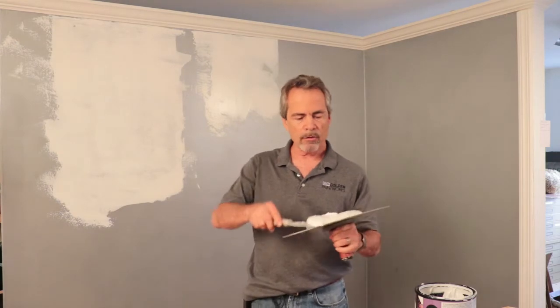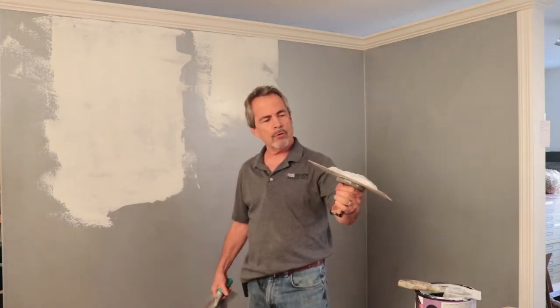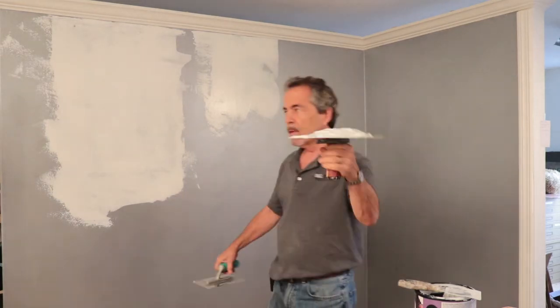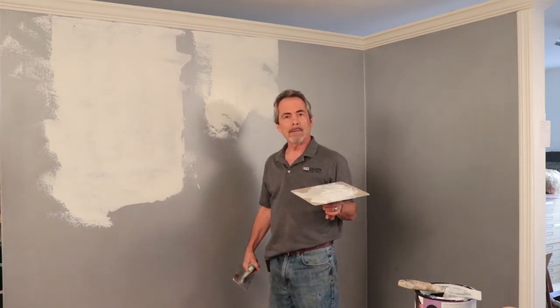If you do want to work with a hawk, let me show you how. The material has to be thick enough that it's going to stay on the hawk. I want to put it right into the center. The material has to be thick enough that you can rotate it down like that without it falling off. This is a fully loaded hawk now. The material is fairly loose — that's probably about as high as I could make it. If you want to make it a little more stable, give it shoulders: go all around it and just bevel it down. That will help it stay on there longer. The way you work a hawk is two motions: you flip up, take some off, and then put it back down again before it falls on the ground.